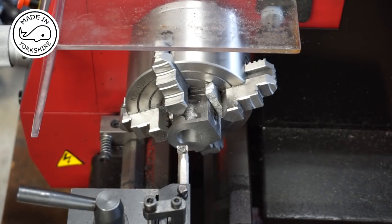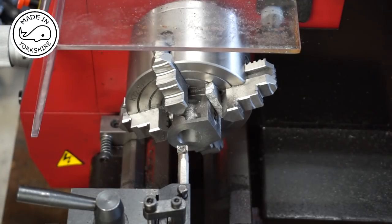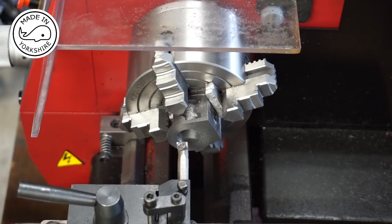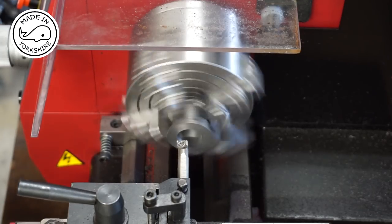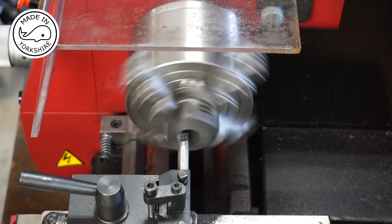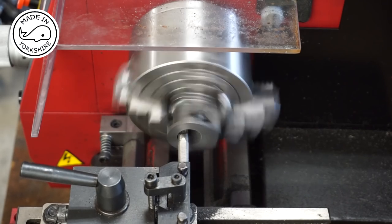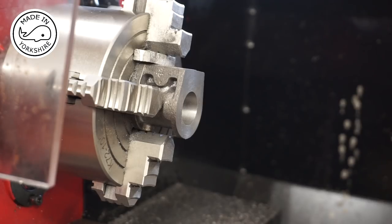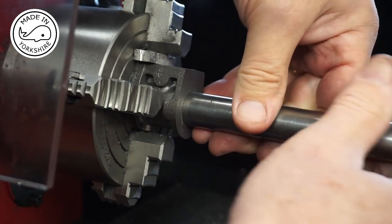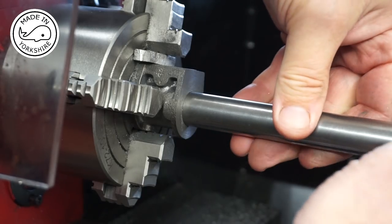There's about 10 thou left to go and I've just changed the tin-coated carbide insert for these cutters that I used to cut aluminium with, so I'll try and get a better finish. I'm going to cut five thou under power feed. This is a piece of three quarter inch bar — that's just about spot on, probably a couple of thou oversize. I'm happy with that.